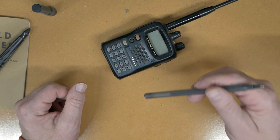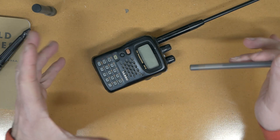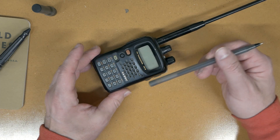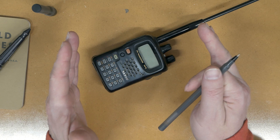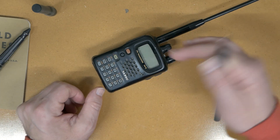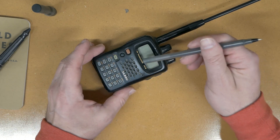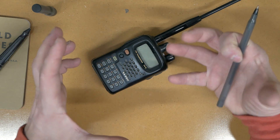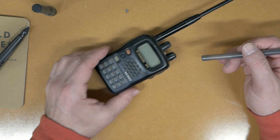I'm kind of paraphrasing a lot of the theory here. The advantages of 2 meters is it goes farther over long distances. They're both FM bandwidth — very high frequency. Where 70 centimeters would excel would be through buildings, but it would have a shorter transmission distance. The 2 meters would be better maybe out in the woods where there's nothing metal blocking you. 440 megahertz and 70 centimeters are interchangeable terms. That actually sounds very clear if you can reach the repeater. Quality-wise, 440 sounds much more FM and solid; 2 meters is a little rougher on sound quality, but it can potentially go farther distance-wise.